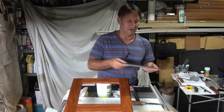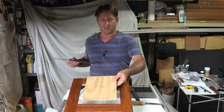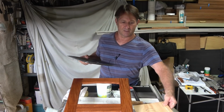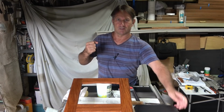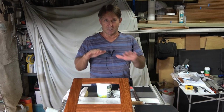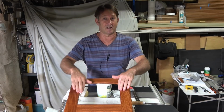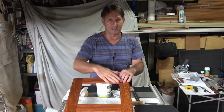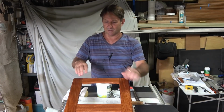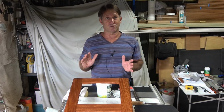And then I've got a bit of timber cut to the right size to sit inside so that then I can put a weight on top, a light weight of 4 kilograms, just to nestle those screens nice and flush with that little rebate edge there so that I get a really close bedding of the insert to the edge of the rosewood to hopefully make it look pretty professional.